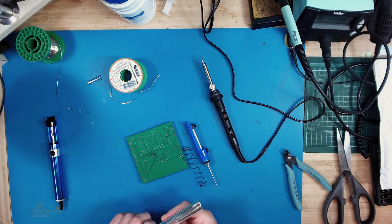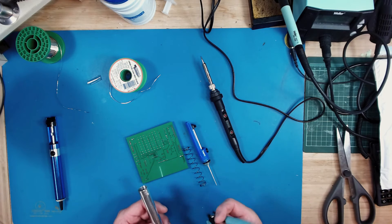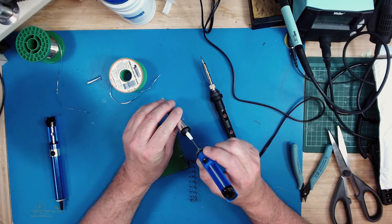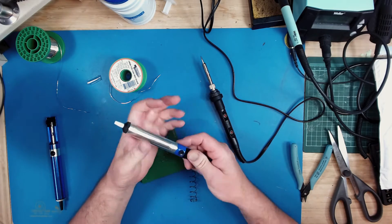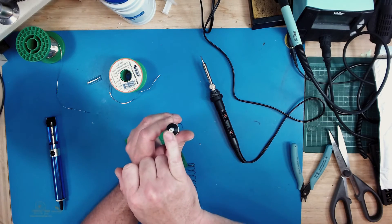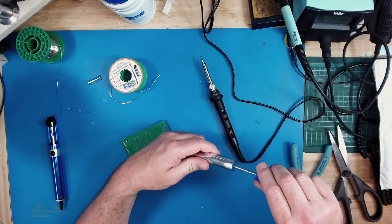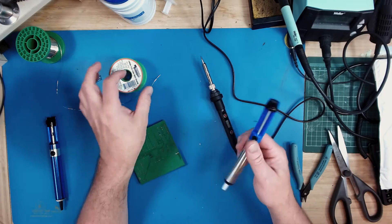Not a replaceable tip on this, but at this kind of cost that's acceptable. It is aluminum, but it's really light gauge. Not overly impressed. This pin wants to be about the same size as the hole, so when you press it down it should actually clear all of the material in the tip, because the tip will sometimes get clogged up. It's not horrible, but I would like to see that a little bit larger. Not expecting this to last as many years as the Advent, but if you're just getting started out, these are basically disposable.